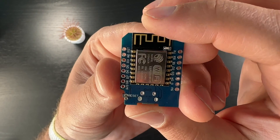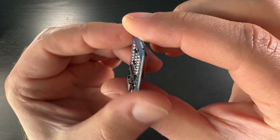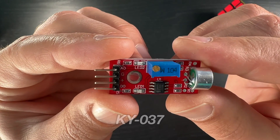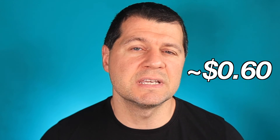The possibilities are endless once you have it working, and to have it working you will need a few things like a D1 Mini board. This board costs 2 to 3 US dollars and I will upload ESPHome software on it, which will allow communication with a smart home hub like Home Assistant. The actual sound sensor needed is the KY-037 model. There is also a KY-038 model that can be used as well with no modifications. The only difference is that the KY-037 has a microphone with higher sensitivity than the KY-038. Depending on what you want to achieve you can get one or the other. The cost of this sensor is around 50 to 60 cents.